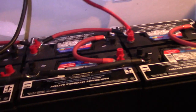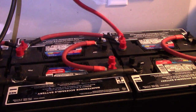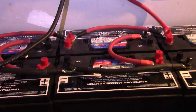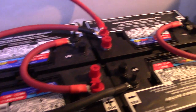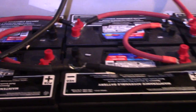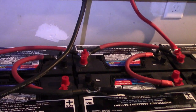I don't want to over-stress any particular battery, so I'm trying to go from one point to the end point. The thing about all the cables I made for the series and parallel connections — you want to keep all the cable lengths the same if you can. You don't want one battery working more than another. These have loops that would have been prettier as short cables between posts, but you prefer to keep everything equal so all the energy travels equal distances.